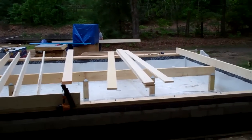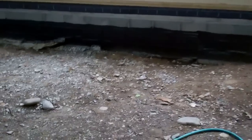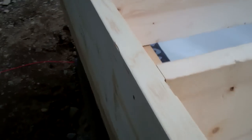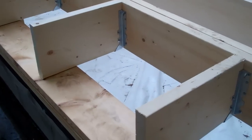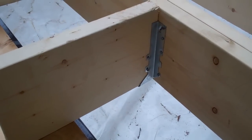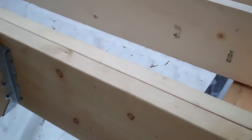As you can see we're making progress, about halfway done. We're using 2x10s for the floor joists, basically nailing them in just to keep them standing. Got a bunch of small ones here — joist hangers. The joist hangers had to be hand-nailed in, but then everything else is pneumatic nails.